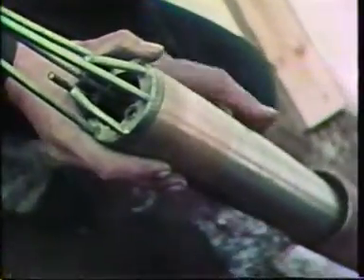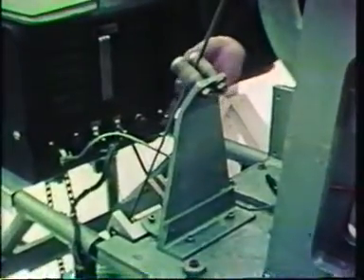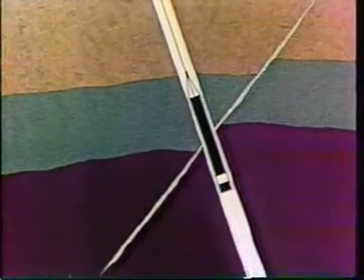The camera is suspended from the lowering mechanism by electrical cable covered by steel wire. The steel wire is wound and overlapped so that the cable doesn't twist during the lowering of the camera — otherwise the camera would of course rotate. The cable can withstand a tension of about 2,700 pounds. Pictures are in fact taken as the camera is pulled up, since the cable tension is more constant and the camera steadier.